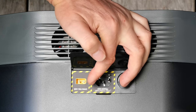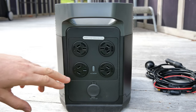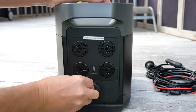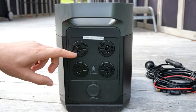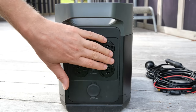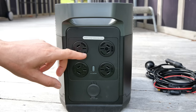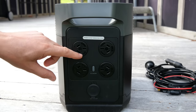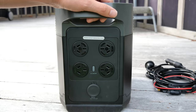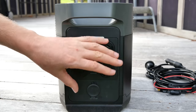It has four cooling fans built in, and there's a panel on the back to plug in AC power, your car charger, or solar panels. On the opposite end from the control panel you have the AC outlets — four of them, plus a car cigarette lighter-style outlet. This is an Australian/New Zealand model so it's 240 volts, maximum 1800 watts across the four outlets. Don't go putting 1100 watts in one and 1100 in another because you'll be over. In the States this would be a 110-volt system with different watt outputs.